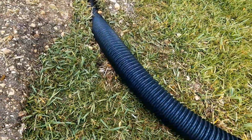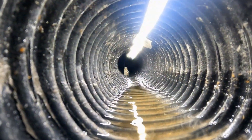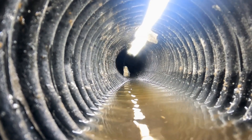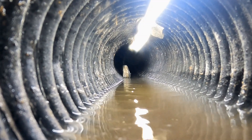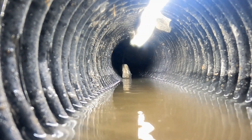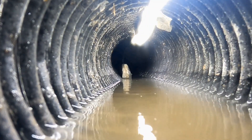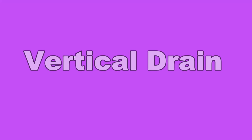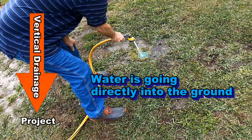You might watch a lot of videos talking about four-ounce, eight-ounce, double-punched fabric — that's very expensive. I was never a believer in fabric until I found this Stay Green. I always found that the heavier fabric actually slowed down the inflow of water into your system, and I have several videos showing how slowly the French drain works using double-punched four-ounce or six- to eight-ounce fabric.